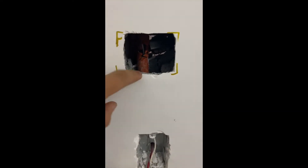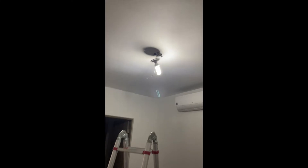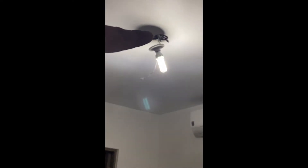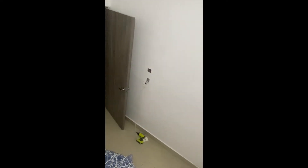I opened up the orange hose that contains the cables from the ceiling lights. I already inserted a guide, which is basically a very strong wire, and that's going to work as my guide for the cable I'm going to insert, because I need an additional cable which is my neutral cable. I already assembled the cable to the guide, so I'm going to try to pull it.